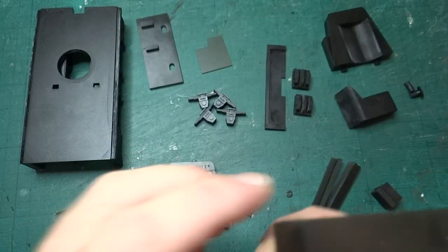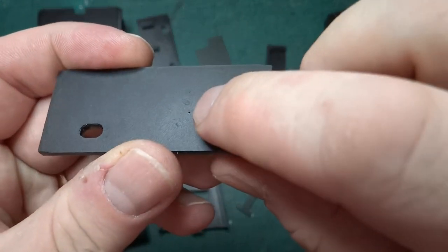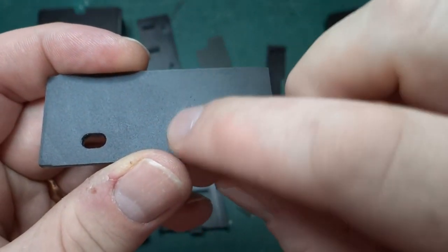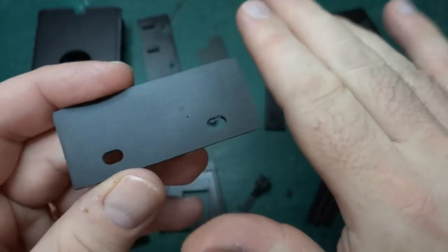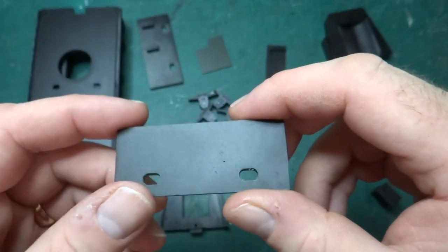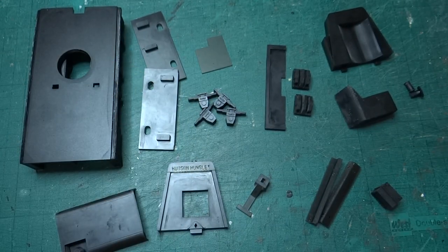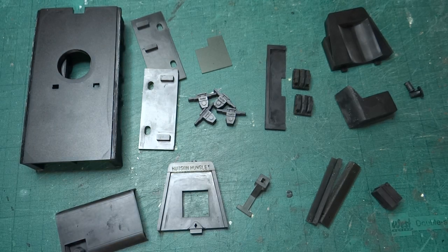Sometimes you'll find that where they're stuck to the base plate, there are ever so slight tiny little bubbles. You might be able to just gently sand the surface and they'll disappear because they're only in the very bottom layer. Other times you might need to fill them. But there shouldn't be too many of those. I've tried to avoid that wherever possible. So that's preparing the prints.